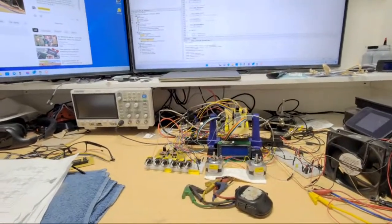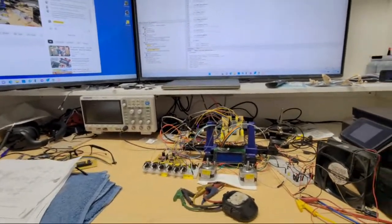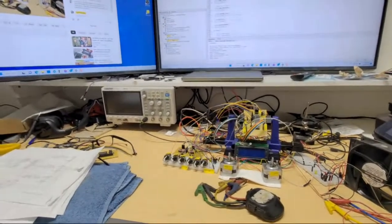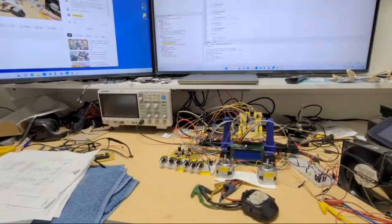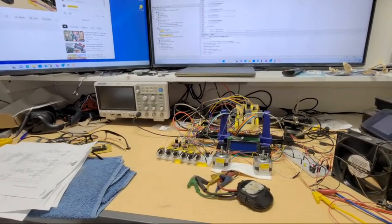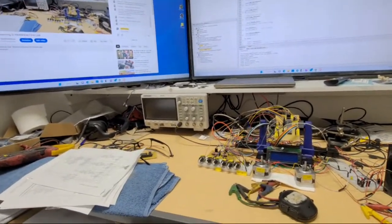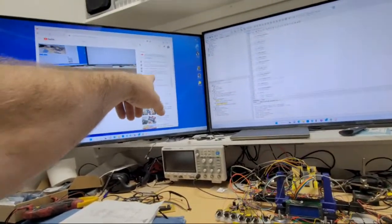But remember, we're used to thinking of AC motors as always determined by the poles. So a 6 pole is like your 850 RPM-ish, and then your 4 pole is your 1700 RPM, or I don't know, sorry, it's like 1075, and then your 2 pole is the ones that are faster, and it depends on what kind of motor, I guess. 3-phase versus single phase, but single phase is the ones that are 850 and 1075, and then on your 3-phase, it's like 1700 or 3000-ish RPM. So like 3600, like you're saying.